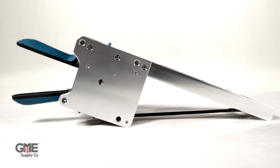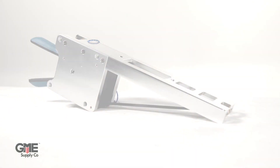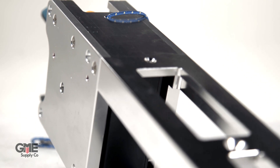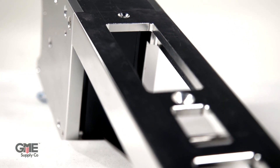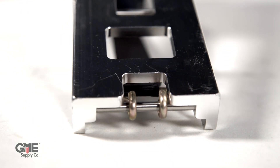As for the tool itself, it has several features that set it apart from other antenna alignment tools. Its patented bracket allows the aligner to be mounted securely and directly to most antennas without the need for additional accessories. The bracket is engineered to enable 18 different mounting configurations, which help the tool automatically provide the azimuth, tilt, and roll of the antenna without having to do any math, regardless of where on the antenna you choose to mount.